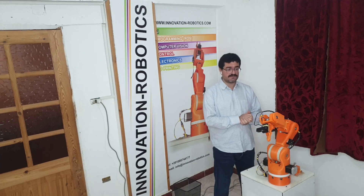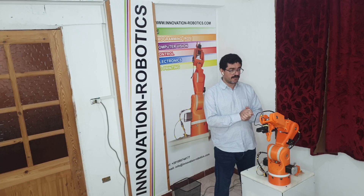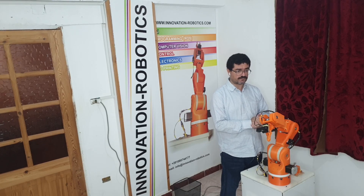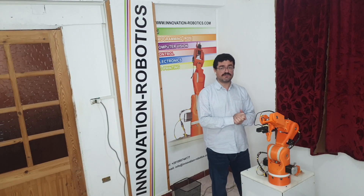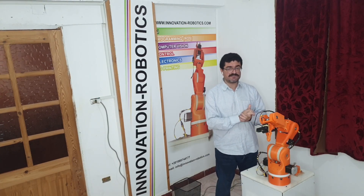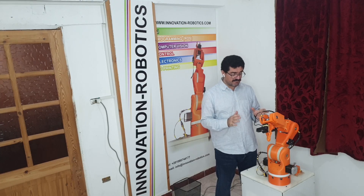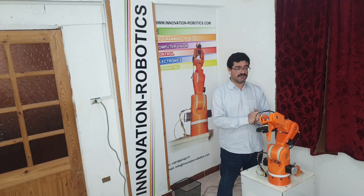The modifications that were made on this robot were made on links 4, 5, and 6 to deploy NEMA 17 motors in order to have more torque, and because they are available in the local market. I also fabricated a 3D printer especially for this purpose for printing this robot, as you can see here.